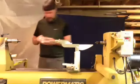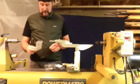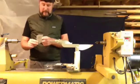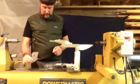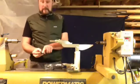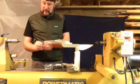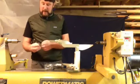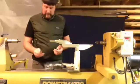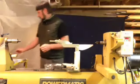While we're talking equipment, for an extra $20-something, it's good to buy the knife sharpening template. There's a jig to set on your grinder to set the right angle. I think it's a 20 degree that you let rest on the base. Then it comes with a fixture that holds the cutter itself. You have to sharpen three different angles, and then the face, and you do that to keep them sharp. It cuts much nicer. I sharpen them almost every time, unless I'm using the smaller 9-inch.